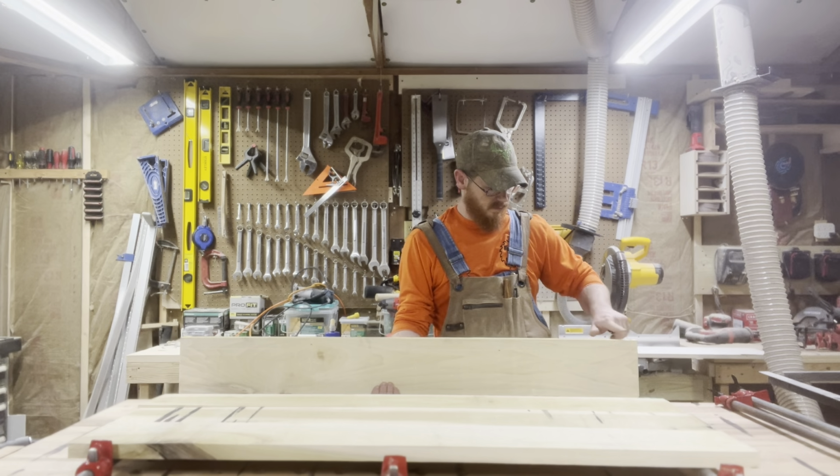Now, something I recommend for this and any panel you do, tabletop, anything, is cut them longer. These are going to be, I haven't really decided on the finish, I think 40 inches is what I decided on for a final measurement. I may go a little longer than that. I don't know. I'll figure that out with the difference of the filters. But anyway, cut them long.